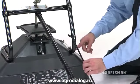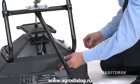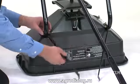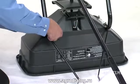Attach one end of each of the two hitch braces, part five, to the inside of the hopper frame, with one on each side. Use one hex bolt, part A, secured with one nylock nut, part D, to secure each hitch brace to the hopper frame, but do not tighten the bolts at this time.